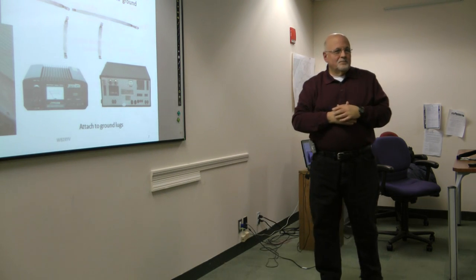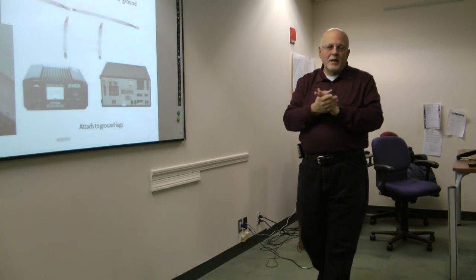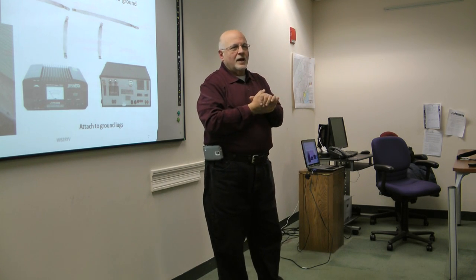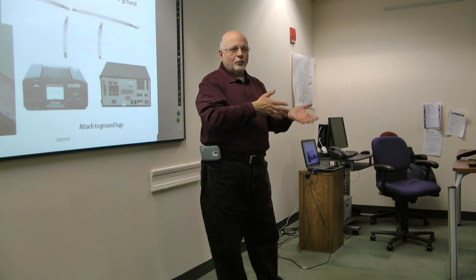I'm going back to when I had a station years ago. Back then, when I did the grounding, I had made one central grounding connection coming into the shack, but I tied it into the water line, I tied it into the radiator pipes, in addition to an outside ground. Generally you're okay tying into the cold water pipes, not the radiator, because the radiator pipes go to the furnace. So by the time all is said and done, there's no real route for it to get to ground.